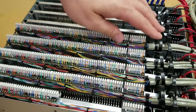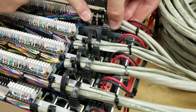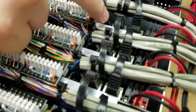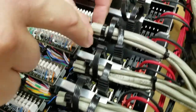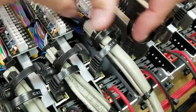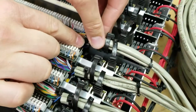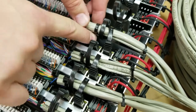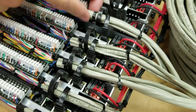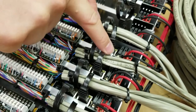Something else we recommend is to manage this portion of the loom ahead of time so that it's out of the way of the board that you would need to remove below. You don't want a lot of interference here, so we basically run this up here and do some more zip ties that help to keep it nice and tucked away. I also recommend rotating the heads of the zip ties down so they don't interfere with the RJ11 connectors or the data connectors.